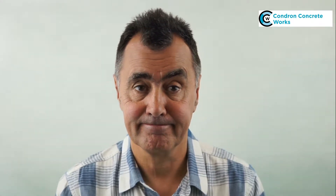I recommend that anyone installing a roof at 22 degrees or below should consider following these guidelines to ensure the whole roof system is watertight. A good example is a house extension where the tiling may not be perfectly flat if, for example, the tiles pass over roof window flashings, or where the tiling may have to cope with extra water runoff from a higher roof slope.